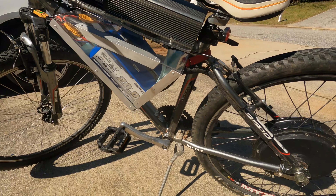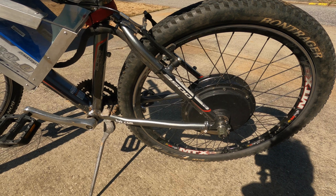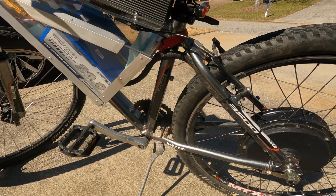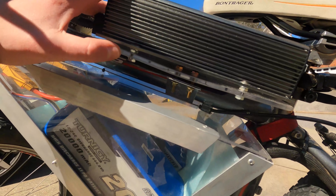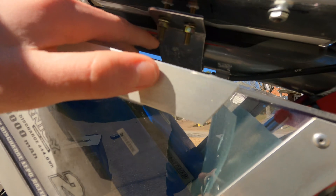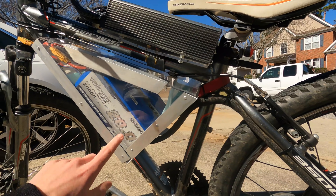I've gone full blast with this thing and not had a problem at all. I know this motor is huge for this frame and everybody recommends the enduro frame, but I didn't want to spend that $600 — this frame works perfectly. I can just make a battery box, mount the controller, and go. To mount the controller, I have an acrylic plate screwed into an aluminum bracket that uses a v-clamp under the frame, which keeps it in place — super tight, very solid design.